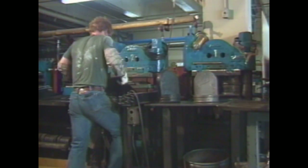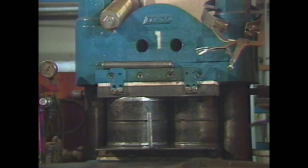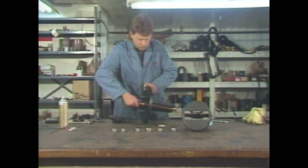The core of the valve insert is cast of ductile iron for durability and is completely encased with SBR rubber. The brass stem is turned in our computer-operated lathe and passes standards specified by the American Water Works Association. Each valve is assembled individually to assure the best quality control.